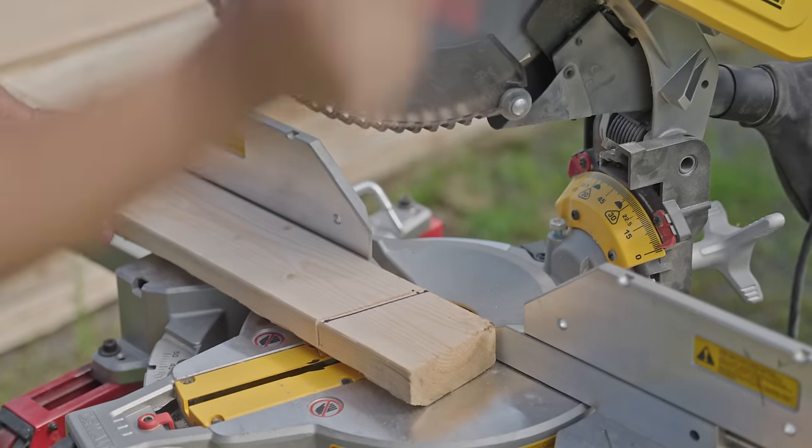Anyway, let's go through a couple more of these framing details that are part of the roof. One of them is this piece right here. This is a 10-foot 2x4. It goes right from the face of this wall to the other side. We're tying it all together in a triangle pattern. There we go. Now the rafter and this brace are tied together. It becomes a truss, okay? And what that is, is this ability that no matter how much weight you put down on the top, it can't bend the building out, because this holds it together. So now you've got one complete, strong triangle structure, and that's going to be all tied together.